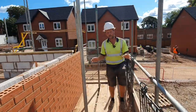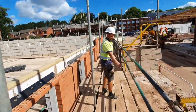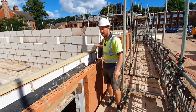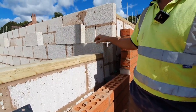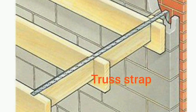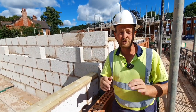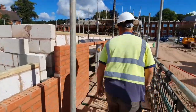That's how you should leave your job. Every single lift that you do, that's how they want it. The only thing that needed doing, really, is a little sweep off of this loading bay, but other than that, that is how you should leave it. With these party walls, make sure you're no more than that above the wall plate, because when they come to put this truss in, the strap will land over that block. So if that's why I would have built these up higher, you need to leave that down at that height, so when the truss straps come in, they'll go over the block. And it's a good job — the joiner's going to love me. Trust me, I'm a bricklayer.